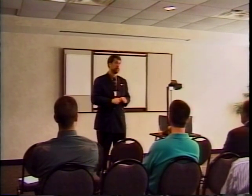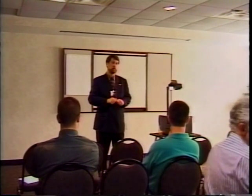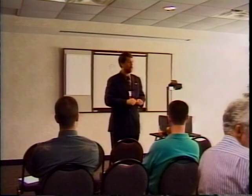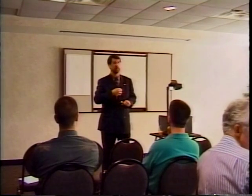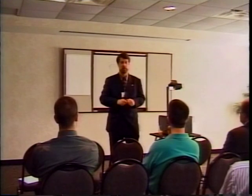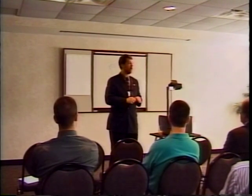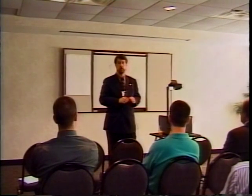Yes, sir. At the same time you talked about the amplitude, some of the timing machines will give a beat error in milliseconds. What's a typical tolerance for high-grade watches that you do with them? The question is, what's the tolerance in milliseconds on your timing machine for beat error on a high-grade watch? I believe as long as it's one or less, you're all right. 1.0 or less.